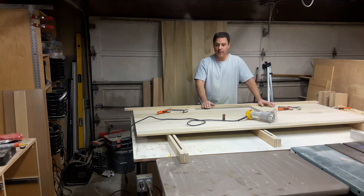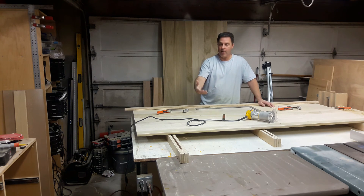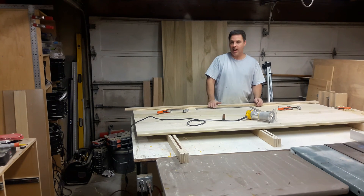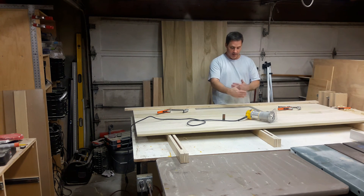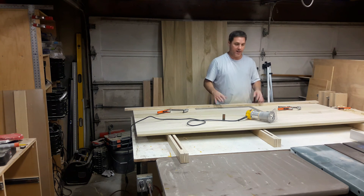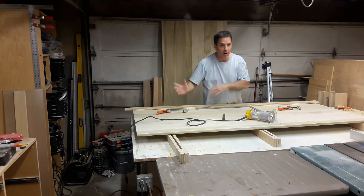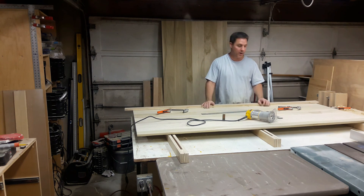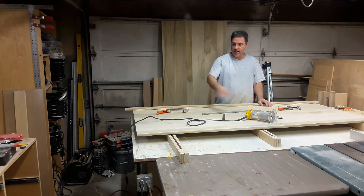That's really what you're shooting for when you do this kind of custom work. It's very difficult unless you do this same thing every day for a long time — you learn how to improve yourself as you go on. Could I have sized the doors differently or used a different jig to save time? Probably — I could build a jig with pieces of plywood at the right spacing and just clamp it on and do all the grooves at once. But I don't have time to design and build that, so it's just faster in this case to do them one at a time. Anyway, let me get to finishing these grooves, and then we'll talk about how we're going to finish it.